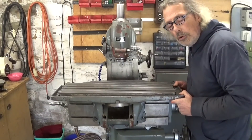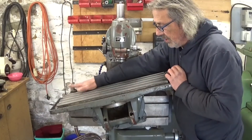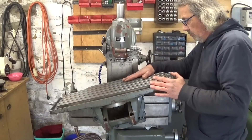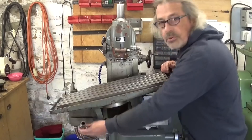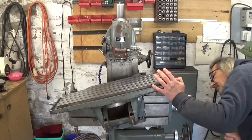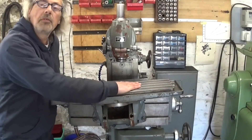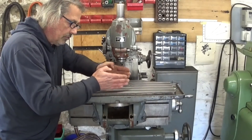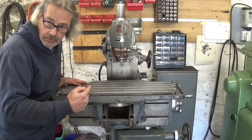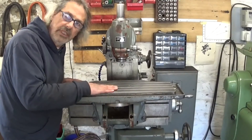In this direction for the moment I can tilt 12 degrees and then it's touching the other side. If I tilt it a bit to the front and take my drainage pipes off, I think I can go completely round. Indeed, if I take this table off and put a smaller table on, or the vise directly on the support, I can do 360. That's maybe not really useful, but it can do it.